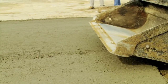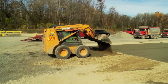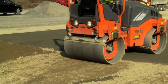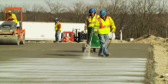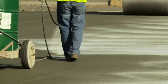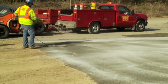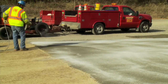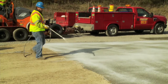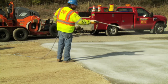The edges of the paved area can be finished as desired depending upon the site requirements. In this case, aggregate material is filled in to create a shoulder against the edge of the paved area. The rolled surface is then sprayed with AquaCure. This liquid assists with the cure and sealing of the surface. Overall, the process requires one quarter of the time of the equivalent area of conventional concrete pavement at one-third the cost. The roller compacted concrete will be cured to full strength within seven days of placement.